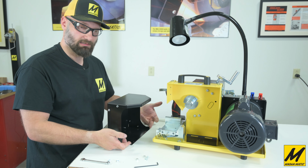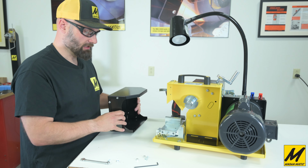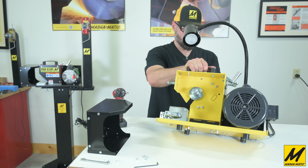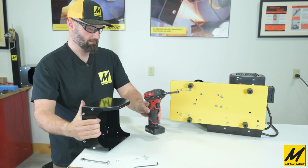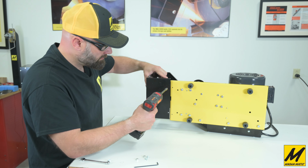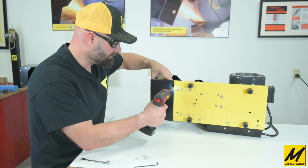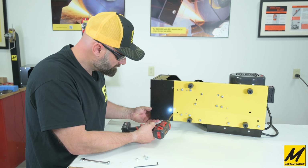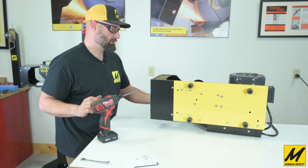And the next tip is I like to connect the bottom to the sharpener first, then I very easily see which holes line up. So we can do that by turning the machine on its side. So I'll tip it back here to expose the bottom. And then we'll take the grit guard, turn it on its side as well. And the lips just fit inside the same way onto the base of the unit. We'll put these 2 screws in. Now we'll tip the machine back up again.